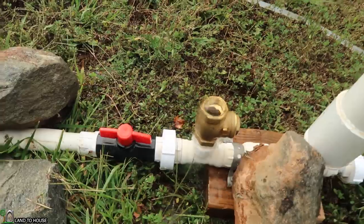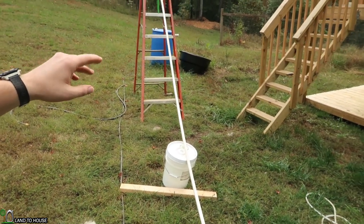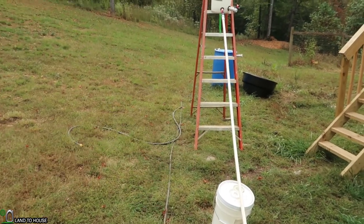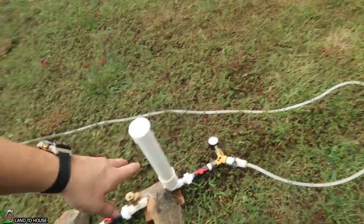Let's call it four minutes on the dot. From those numbers, you can see that lower head pressure used more water because it ran out quicker than the higher head pressure tests. And of course, the higher up you go, the more head pressure and the more delivery pressure you'll have. So if you have a low head pressure setup, you're going to need more gallons per minute to operate the pump — just keep that in mind. Thank you so much for watching. Leave a great comment down below, and I will see you in the next video. Bye.